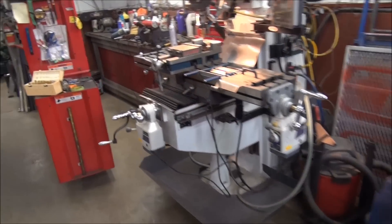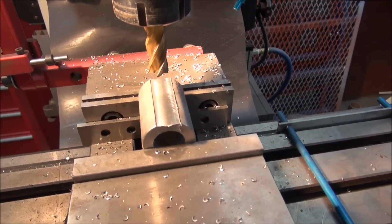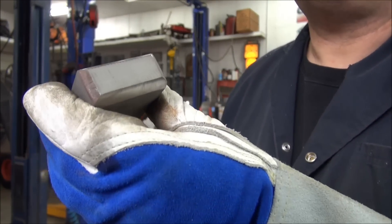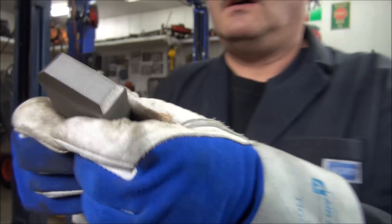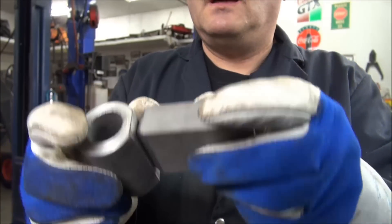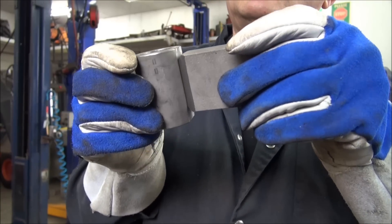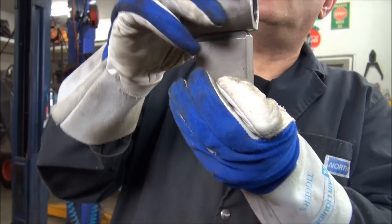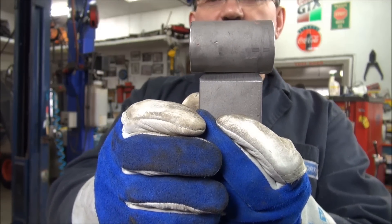So now I've put the end of the cylinder into the milling machine and I've milled a bit of a flat spot on it so that when I put the three inch extension it'll fit better. I've also taken that three inch block and tapered the sides of it, because now when it fits together I'll be able to have a little bit better penetration when I go to weld it. It's not going to be a lot of force on it, but it's nice to have it as strong as you can possibly get it. So let's go weld it now.